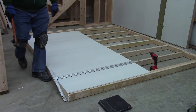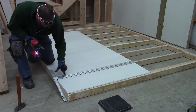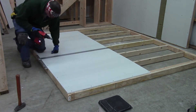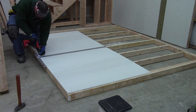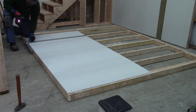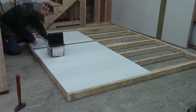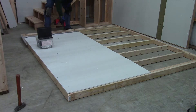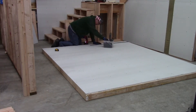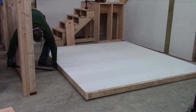Just follow along and you'll see how this goes. When I do the short leg wall for the short section of stairs that's already up, I'm going to build the wall but the sheetrock is going to extend over three quarters of an inch. I've already left a space for it to go in the long wall, so it'll fit together.